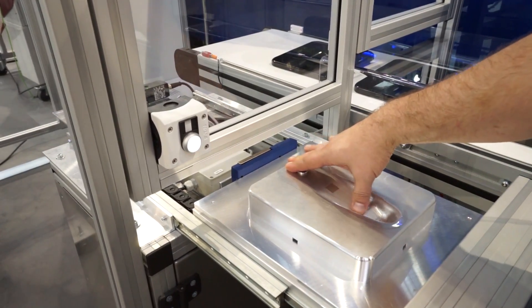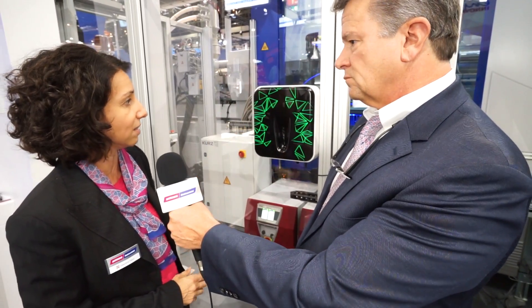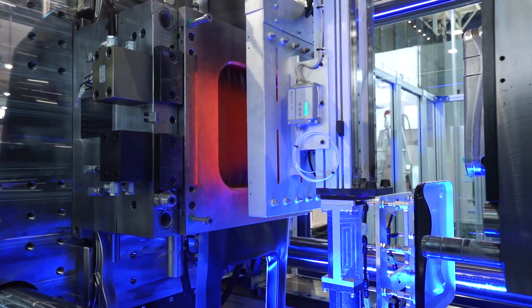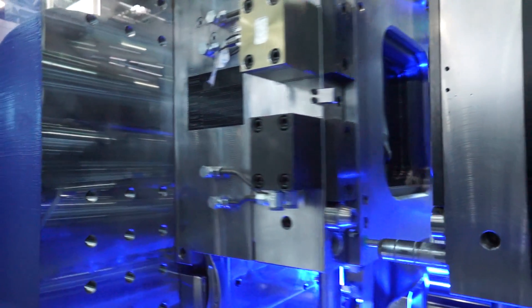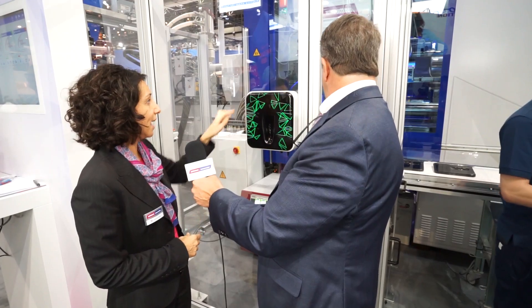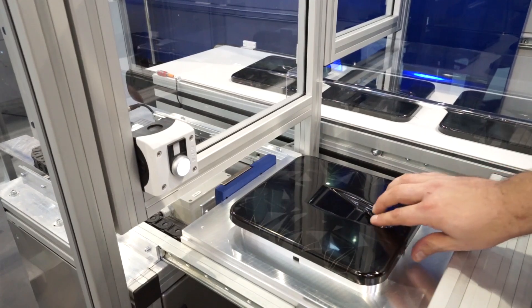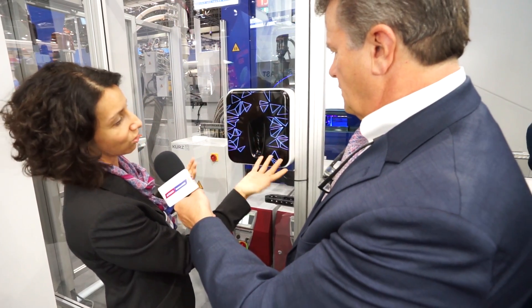We have two foils. The first one is a printed sensor on plastic that we use as a touchscreen — it's placed on the robot. The second one is a black foil which is placed by the robot directly into the mold. It's heated with an infrared sensor and formed to shape, then placed with the sensor inside. It's cut, and then injection takes place to produce — in only one step — this final product. It has a touch experience for the automotive cockpit: you can push it to change the color or dim the light.